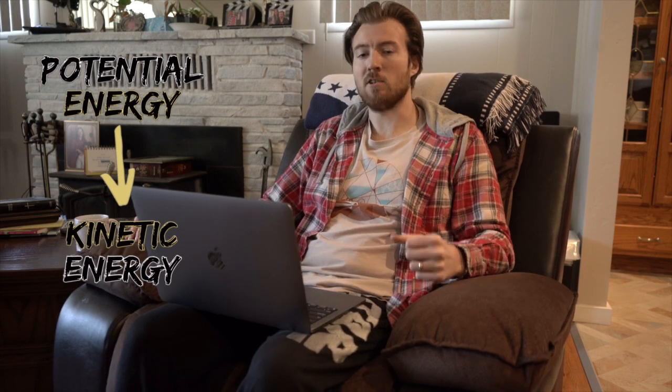Normally an anvil is going to be about your waist. The rule of thumb for anvil height: you put your arms at your sides standing, and where your knuckles are — wherever they touch — that's where your anvil should be. Because the whole point of your hammer swing is you're lifting it up and basically letting the hammer fall, just kind of guiding it. You're not forcing it down. So you want that height so the hammer has the most energy when it hits the metal.